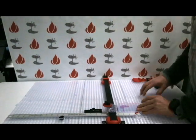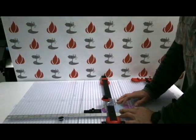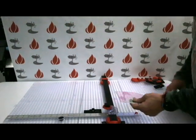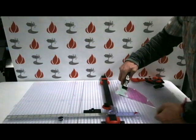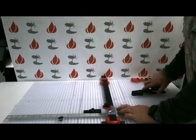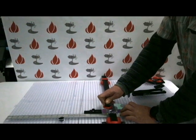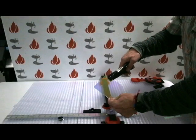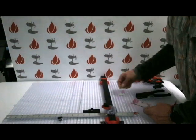The cut stop can be added and adjusted so repeated straight cuts can be made very fast. Here I have set the cut stop to one inch — let's cut some strips. A set screw underneath the cutter head can be adjusted to make perfect cuts on glass any thickness up to a quarter of an inch. Here we are cutting sixteenth of an inch glass. I'm using Fletcher running pliers to complete my breaks. We feel the Fletcher running pliers are the best breaker out there for any fine and detailed work. A new set is extremely nice — you'll notice the difference once it's a year old.